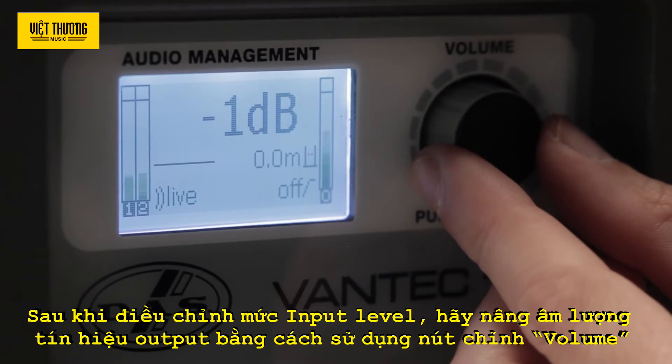Equalizer. For a more precise adjustment, the Vantec system's DSP incorporates a three-band equalizer. The range of each band is -10 to +6 decibels. The low and high bands are shelving type filters, whereas the mid band is a bell type filter at 630 Hz with a Q of 0.75. To change each EQ parameter, select the desired band, press the button, and turn the volume knob to boost or attenuate that frequency band.